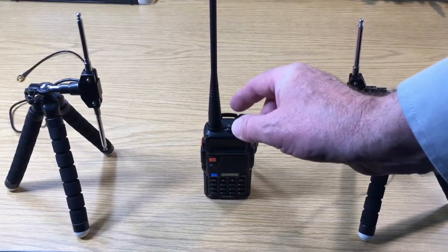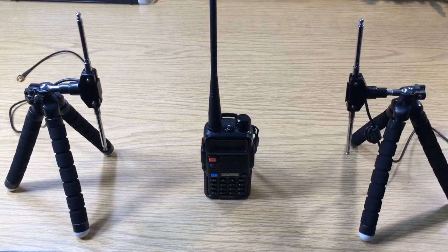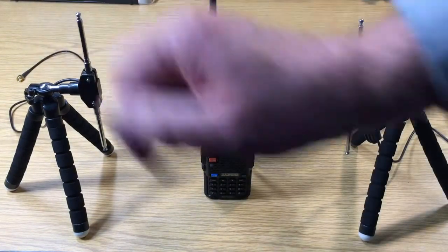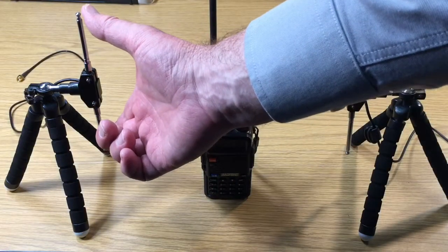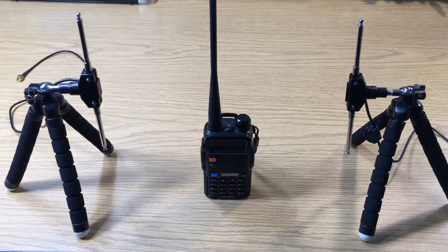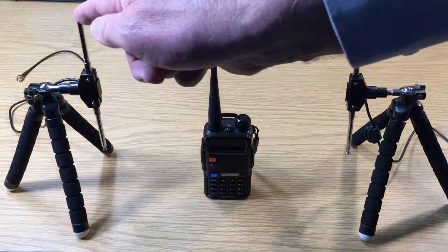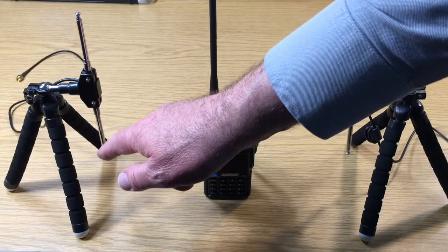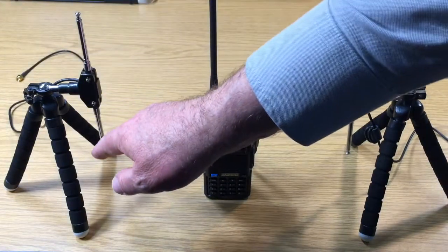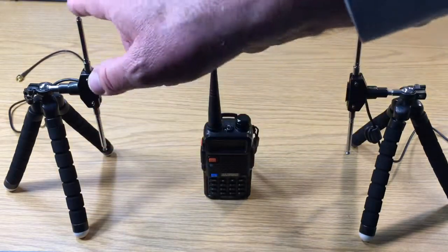The antenna, as we can see, is a vertical mounted on the top of the transceiver. We talked about antennas in general and like these little two model antennas I have — one will represent the transmitting antenna, one is the receiving antenna. Now typically we would have what we call a vertical dipole, which means that it's a half wavelength. For two meters, take two meters divided by half — that's one meter — so one meter would be the distance from the bottom tip to the top tip.